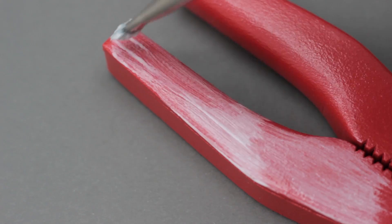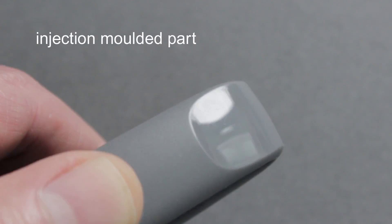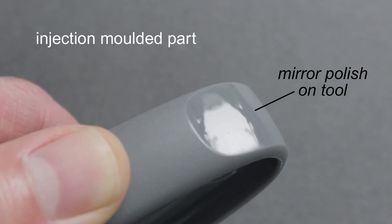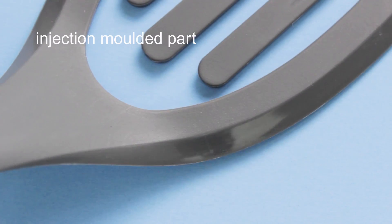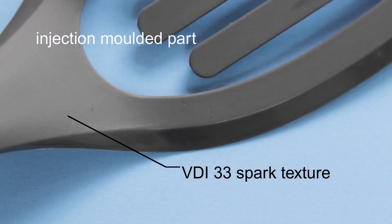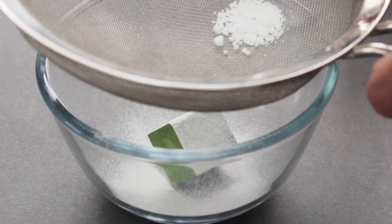Once you have a good spray job, if you want a shinier surface you can coat your model in gloss, or a cheaper technique is to paint on a thin coat of PVA — it dries much faster but isn't as good a finish. PVA goes on white and dries clear, so as you paint it on you think you've messed up — just wait. Don't forget texture: it's not just for grip but to help define areas and add interest to your designs. Designs with one molding can only be one color, but you can add visual interest by defining areas with texture or smooth shiny surfaces. In injection molding tooling, texture is known as 'spark' and there is a rating for how heavy the texture is. To create a textured part, one method is to use gesso or another paint on a fine roller and don't sand back, or you can paint your model in glue and cover it in fine dust.